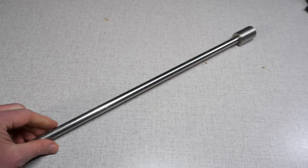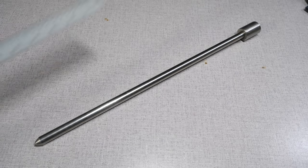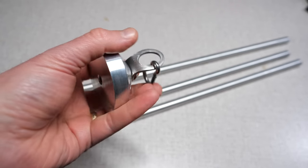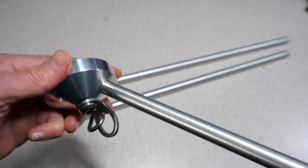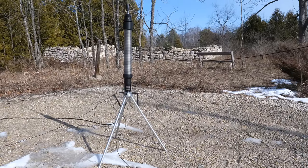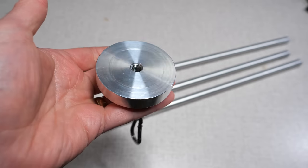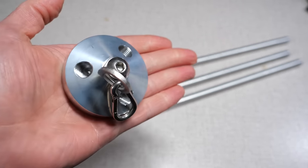The Ranger 80 system comes with a stainless steel ground spike that's 17 inches long, similar to the design Chameleon sells. For hard or rocky soil — or like me, frozen ground — Res Antenna offers an accessory tripod called the Z-Pod, machined out of aluminum. It's 15 inches tall with half-inch thick aluminum legs and a 17-inch footprint. The most innovative feature is the ring on the bottom, so you can add a sandbag or other weight to keep the antenna upright in windy conditions.